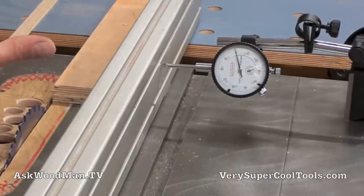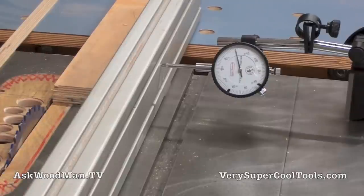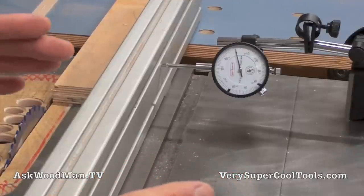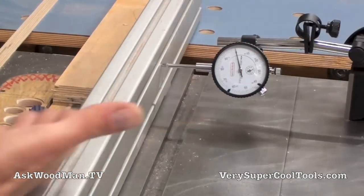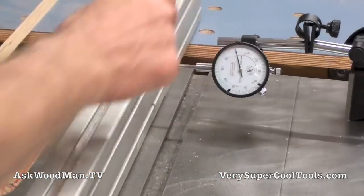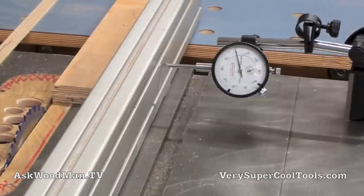If you're having to jam your stock against the fence to get a true cut, you need to work on adjusting your saw — and that's very easy too. I'll have a video on that at some point. I have a precision plate that my business partner Jeff loaned me; you put it on the arbor, then place blocks at each end and use a dial indicator carrier in your miter slot to test against it. This style of saw has four big bolts at each corner — all you do is loosen them and rack the cabinet base until you're within a thousandth of an inch or less, then lock them down. You align everything to your miter slot and then set your fence to your miter slot too.